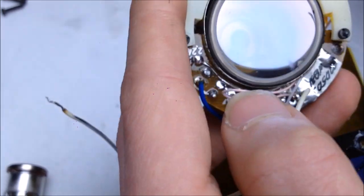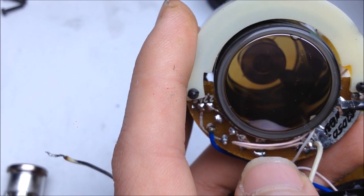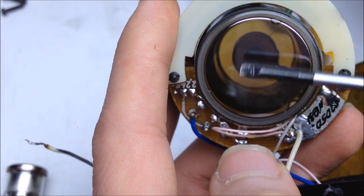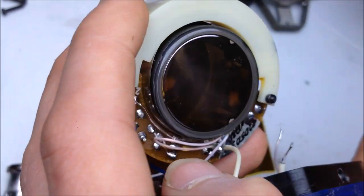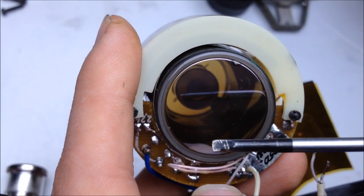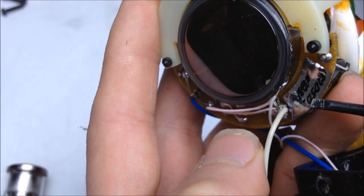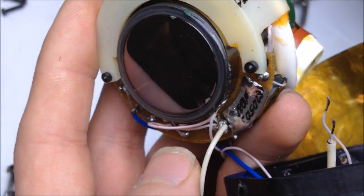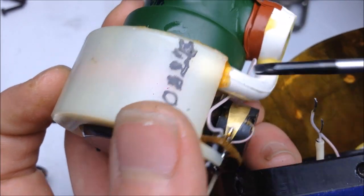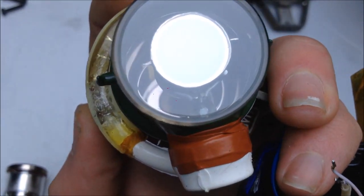If we look at the optical side of it, the high voltage side, we have the image intensifier tube itself. And the first thing to note is the photocathode. So this layer right here, you can see, kind of has an orangish silver reflective coating on the inside of it. And what that coating does is when photons come and strike the plate, this releases electrons off the negative terminal. You can see how it's grounded here, around through to the chassis. After the voltage multiplier, we have this high voltage line right here, and it feeds into the inside of the tube. I'm going to turn off that sharp light, see if I can backlight the inside of the image intensifying tube. You can see a little bit inside of it.